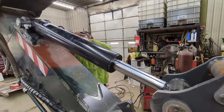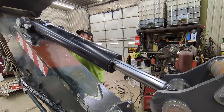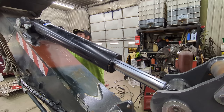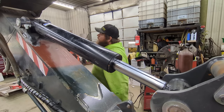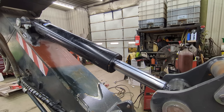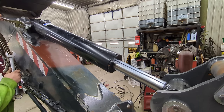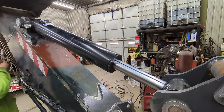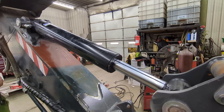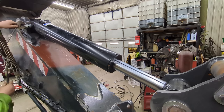The guy from Werk-Brau said that he's seen it done both ways, just welding the sides and not welding that, and he's seen it welded, and he hasn't seen a problem yet. So I think we're just going to weld it up and seal it up, and we don't have to worry about anything in that crack, especially if water or something were to get down in there and freeze, which I don't think it would ever pop any of this off, but it would cause rust and corrosion. So let's go ahead and seal it up. I'm going to get the welder and get started here. I'm going to finish running the rollout of wire that's in there, and then we're going to switch to the Arccaptain lead, and then we'll weld it the rest of the way.